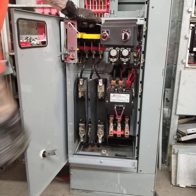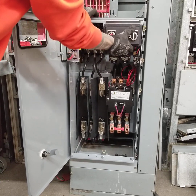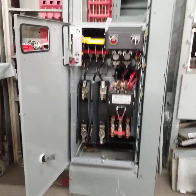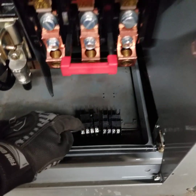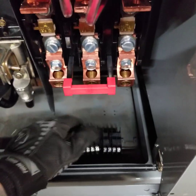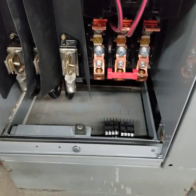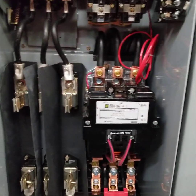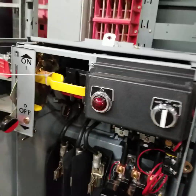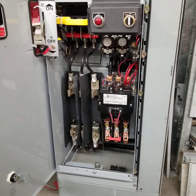To put one back in, just go in reverse. The only other thing to note is that these units have pull-apart terminal blocks housed down in the bottom section — one part of the harness stays with the bucket, one part stays with the cell, so you'll need to disconnect those blocks. Other than that, the unit is out, disengaged, and ready to be removed, replaced, or whatever the case may be. That's it for today, thank you.